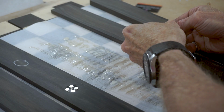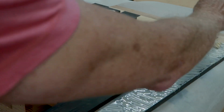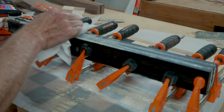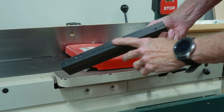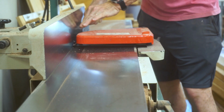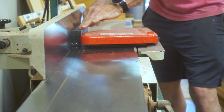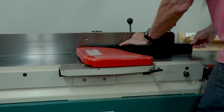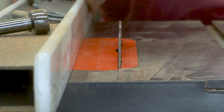For the longer pieces, I ran out of 20mm magnets because I hadn't planned to double them up, so I added 4 1/4" magnets for the second layer. It won't be quite as strong, but it'll still provide enough holding power. You can see the glue line before jointing, so I'll remove that. It's kind of cool how the piece sticks to the fence. Next, I'll cut the frame pieces to be 2 inches wide.